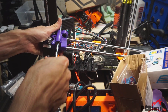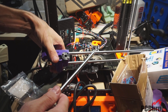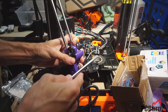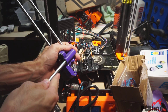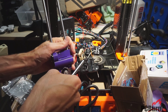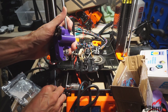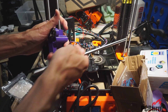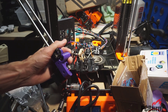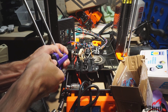And back to my mess of a 3D printer. I had installed Igus bushings on the z-axis because they had a little more play on them already and it didn't really matter that much. They're just what I happened to have on hand at the time when I needed to replace the bearings with something. They've worked okay, but this really needs to be designed to apply more pressure to the bushing if you want to use those. This rod is the one that's off a bit and so is the other z-axis rod.